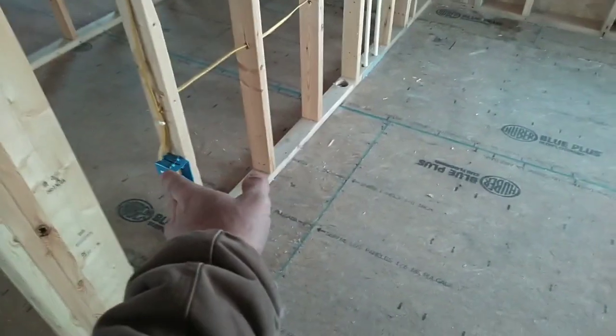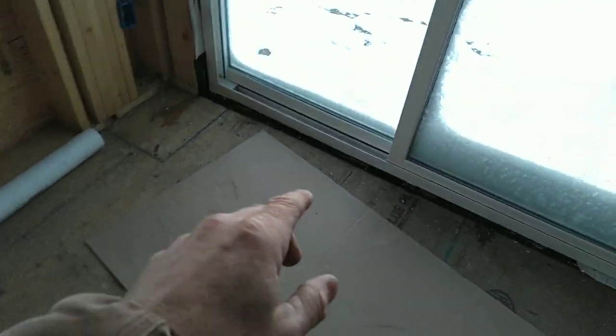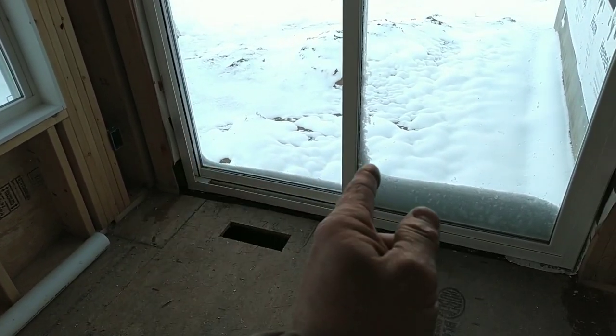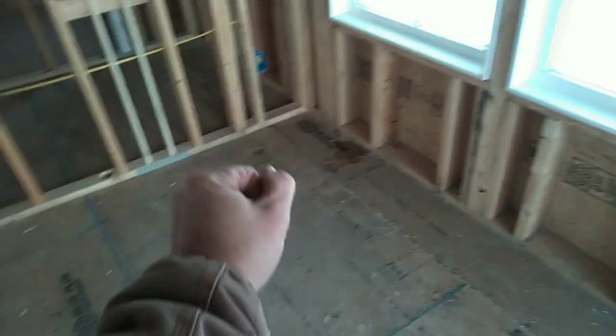This is the dining room area — outlets one here, one there, and one there. A lot of people might not know it, but this is a sliding door. The non-functioning part accounts for usable wall space. So within six feet of the edge of that door, I have to have an outlet — that's what that outlet's for. That outlet to the next is within 12, and that one to the next is within 12. You also have to have one within six feet of the edge of this doorway, breaking up the distance between these three outlets — this is just the best place for it.